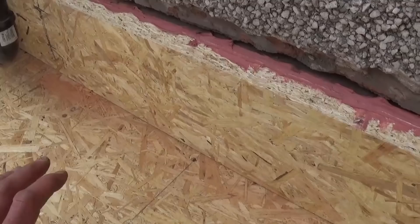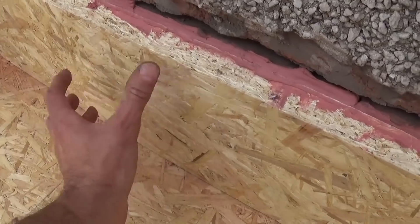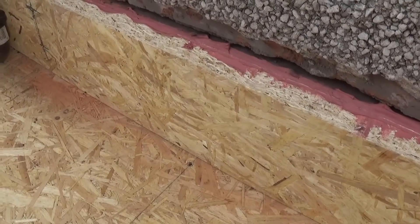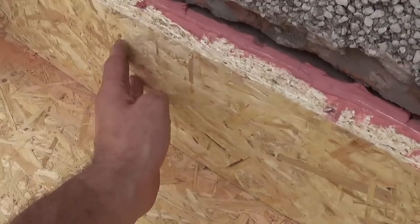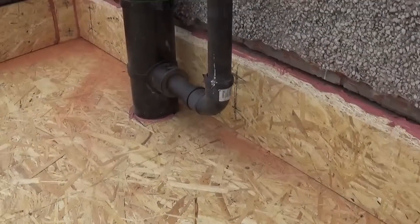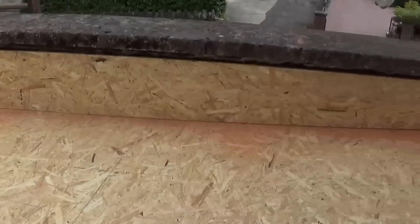We've screwed it up tight - that's going nowhere. The adhesive that you purchase as part of this roof kit bonds a lot better with the smooth OSB surface than it would with ruffled bricks. There's obviously dust on an old house which you'll never get rid of 100%, so it gives a much better bond. If you can put an upstand, it's a lot better than just doing it against a brick wall - not essential, but will give a better job and a nicer finish, because you'll have a smooth finish where the rubber curves up, nice and uniform all the way around.